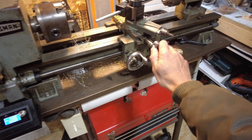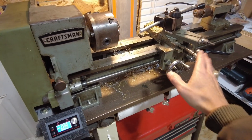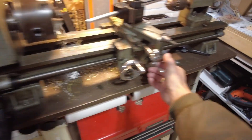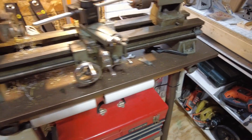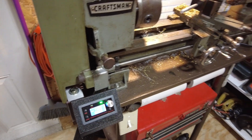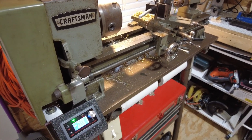The only thing you would do is adjust your depth here, unless you want to put another stepper on this — which we're not doing right now. But as far as this goes, we've got our lead screw, our half nut locked. We can go here and then it automatically comes back.